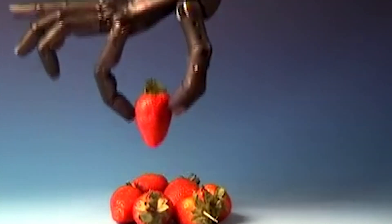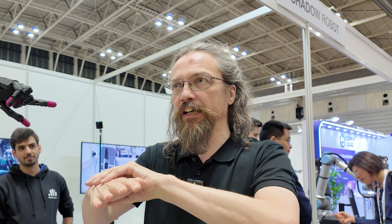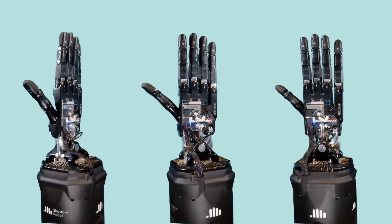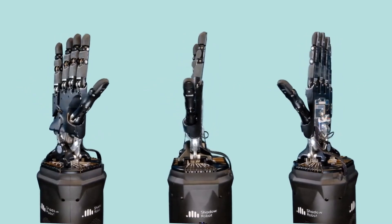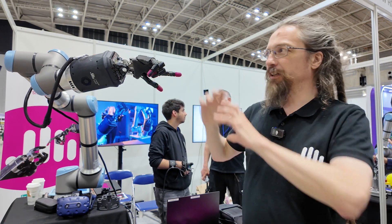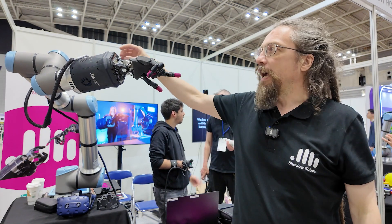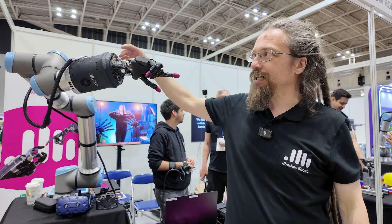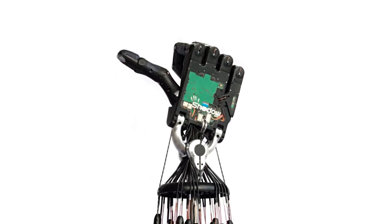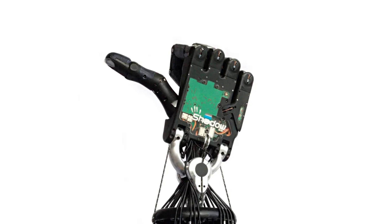After that we built a couple more versions where we kept iterating on that idea of making something as human-shaped as possible, and that is a design challenge with a whole set of design compromises. It has tendon drive from motors on the forearm. This actually makes it quite long and bulky and also quite complex mechanically, because we have to try and route these tendons through the centres of all the joints to minimise coupling across them, and that's actually surprisingly hard to do.